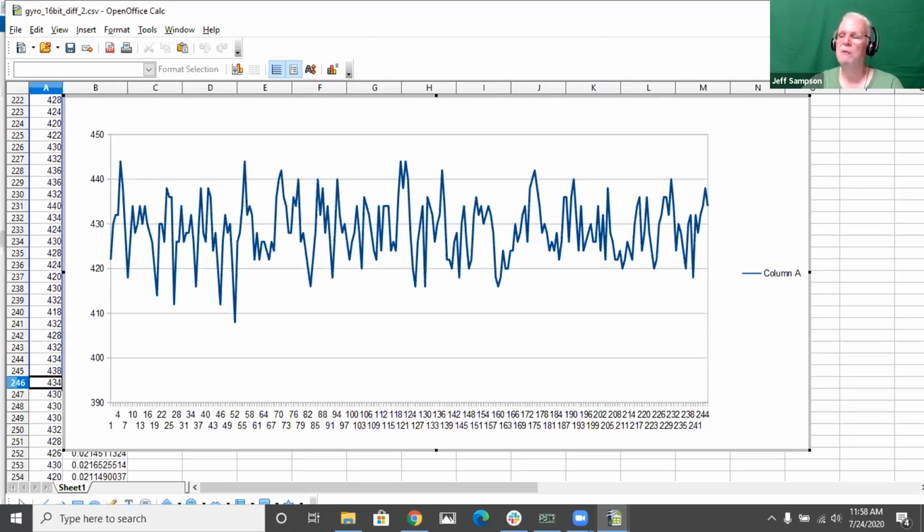But my problem has always been on every gyroscope, if I go back and forth a few times, the thing gives me kind of a step function where each time it creeps. So it starts off here at 0, and I go to 90, and I come back to 0. It either goes less than 0 or more than 0. And I do it again, and each time it kind of steps and just gets further each time I do that. I haven't figured out why it's doing that. So I don't know if there's a bias, say, clockwise as opposed to counterclockwise.